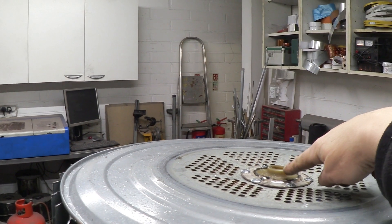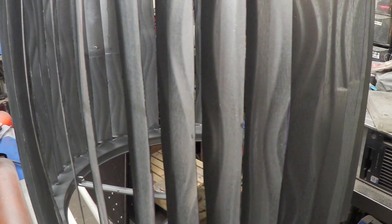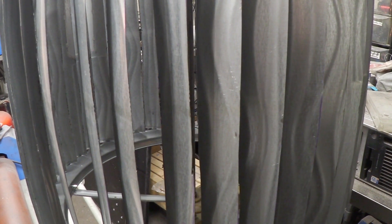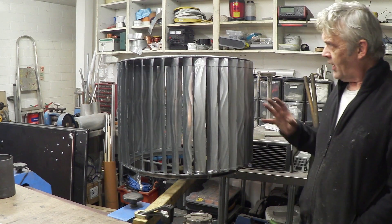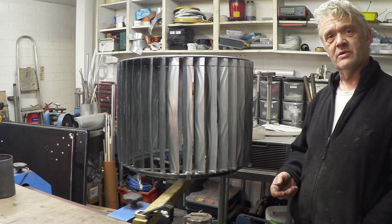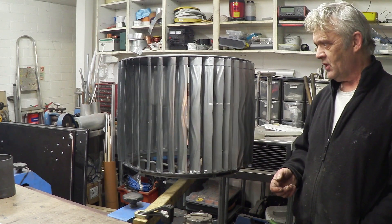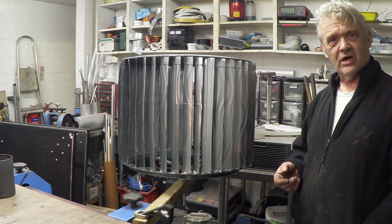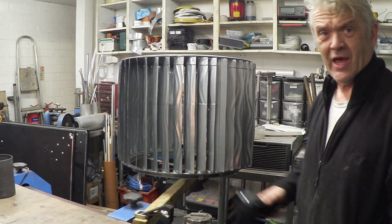That's it in place — the outer edge of the bearing rests on the plastic and the inner edge rests on the centre pole. The centre pole is a bit of steel going right the way through to the bottom bearing, which is held in the centre by stays. There it is, finished. We've had Storm Bella and she's gone now, so it's really quiet at the moment. I'm going to turn a hairdryer on it so we can watch it spin — a hairdryer doesn't give a lot, and it'd be better outside, but we know these designs will spin in the wind.